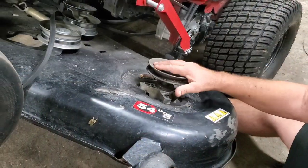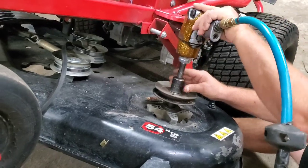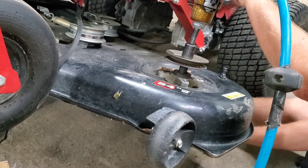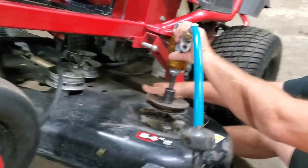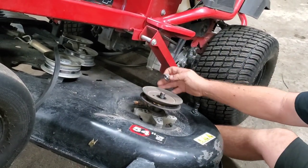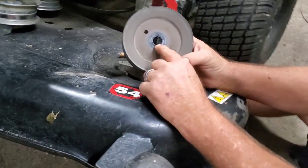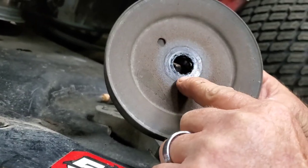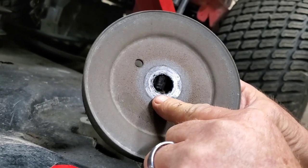Now let's get in and take one of these spindles apart. I'm going to show you how easy it is. If you just want to do this center shaft, I'll show you how easy it is. If you don't have an impact wrench, you can wedge a board up underneath by your blade in the deck — it'll hold it still — then take a pull handle and break this loose. Just that quick. When you're doing these, inspect your pulley. See how fine those notches are? Make sure it's not damaged. If it's damaged, you'll want to replace the pulley. Most of the time, if you haven't hit something, it's going to be okay.